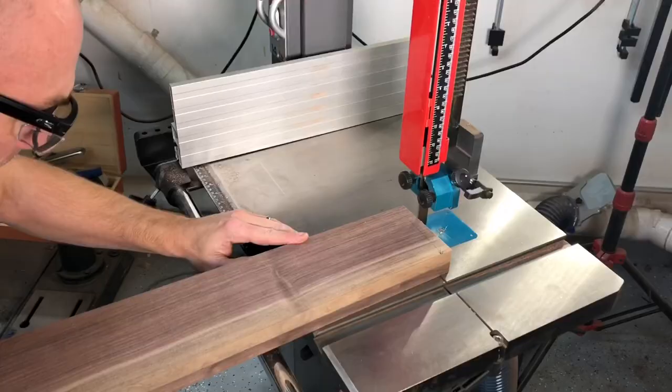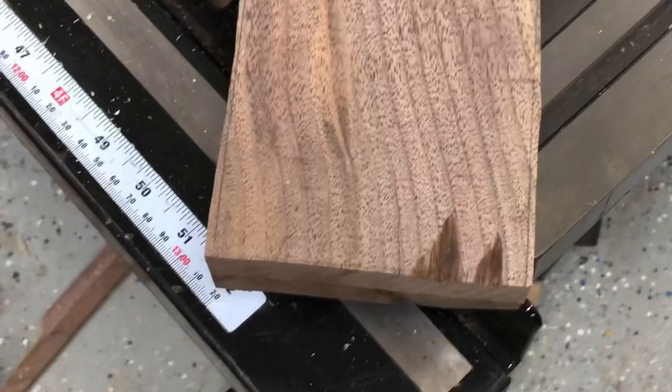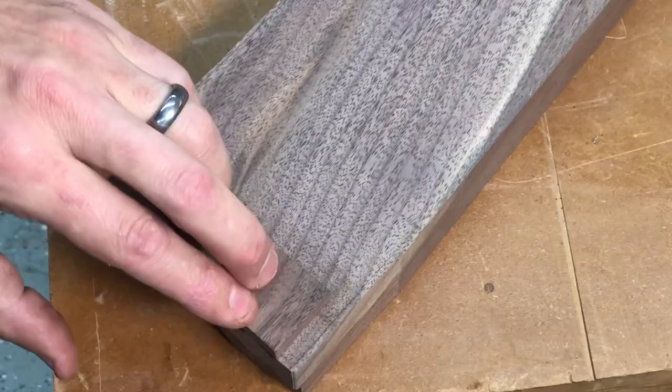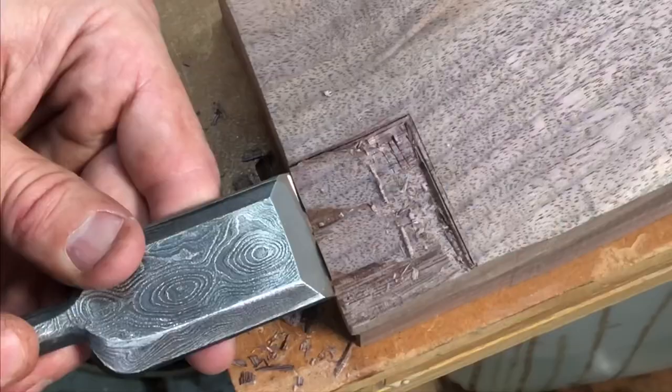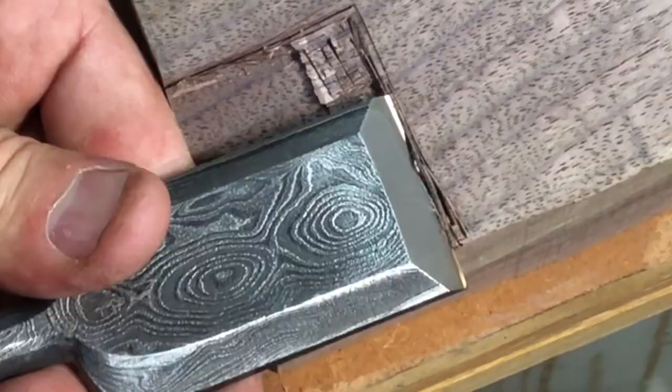Now I've transferred that template onto a piece of plywood that's going to be a little bit more consistent, and I can start to cut out my final leg shape. Before we get into the exact template routing — because I'm not going to cut the final shape out with the bandsaw — I had this bit of blowout, and I needed to fix it. I couldn't just throw a new piece of wood on there; I would have had to do the entire re-saw, the entire bookmatch process, the glue-up, the planing, everything again, and then the wood probably wouldn't even match the other set of legs.